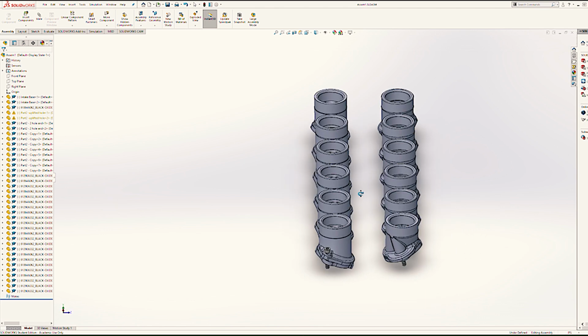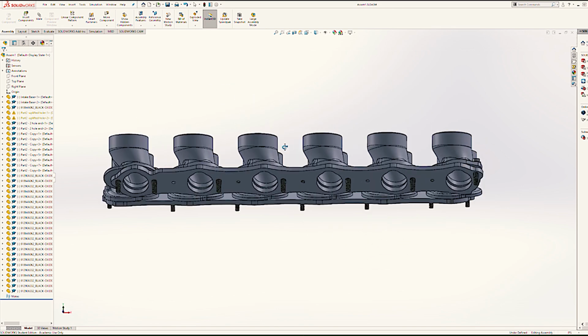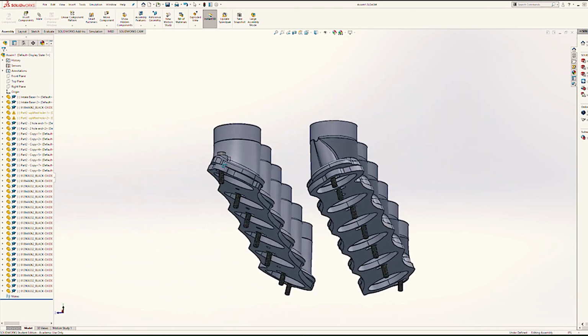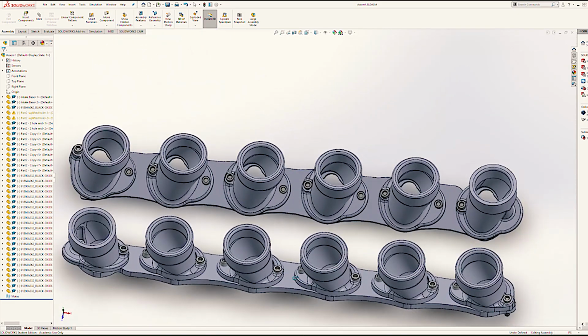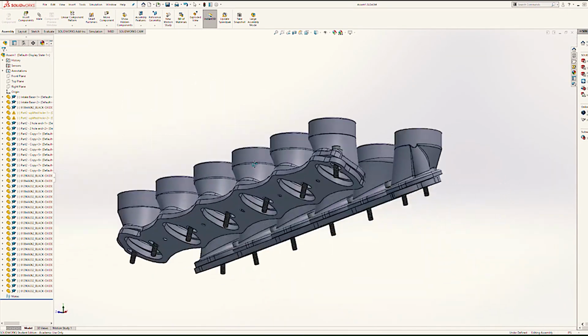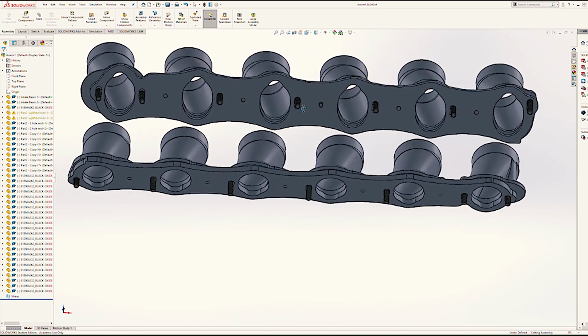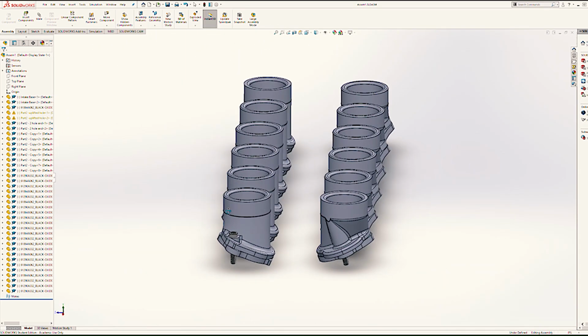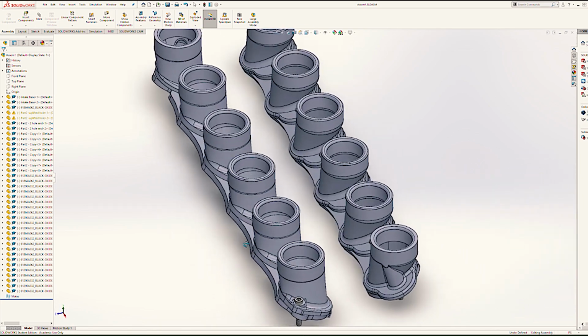So I flow tested these, and I'll go over that in just a minute, but essentially this is what we're looking at here in this assembly. Obviously these bolt into the factory locations, and the shorter screws just bolt into the 1/4 inch piece that is getting cut out on the plasma. And then I matched the outside diameter of these to the outside diameter of the GSXR throttle bodies, so that'll all bolt up.